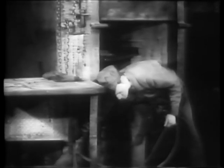When previously hardened steel parts are to be toughened by tempering, they are first reheated. Tempering temperatures are below the steel's lower critical temperature, the temperature at which the steel first began to harden. The parts are kept in the furnace until they are uniformly heated. Thus, tempering time depends on the thickness of the pieces and the temperature to which they must be brought. After heating, the parts are removed from the furnace and allowed to cool in air.